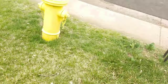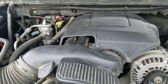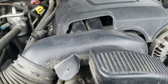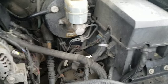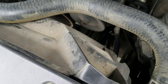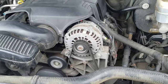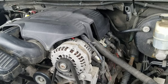Okay, let's take a look here. It's run like this before for five minutes or so and doesn't make any noise. Came back on a test drive — zero oil pressure, at least two miles. Got back here and idled for five minutes. The engine never started to sound like it had zero oil pressure. Things I replaced: it overheated when someone else had it. I replaced the radiator because there was a hole in it. Then it sealed up, no coolant leaks. Drove it home — about 30 miles, no problems. Sat for a week, then zero oil pressure on a test drive.